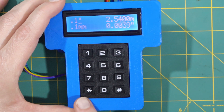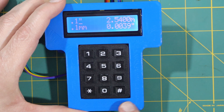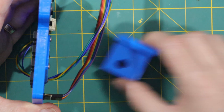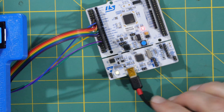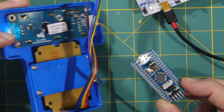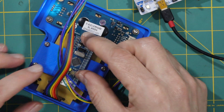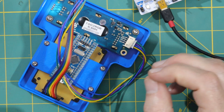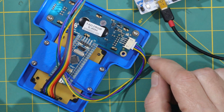One thing I don't like, of course, is that the keys are not labeled correctly — I'd really like to have a period and a clear label. I'll probably put some labels down here to remind myself. The other thing is this is a bundle of wires with a pretty large circuit board. What I'm planning to do for the next version is switch to this smaller circuit board, which will be able to fit in the back very easily — probably so I can have the cord out the bottom. I'll then design a smaller case that will fit this better.